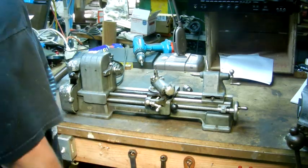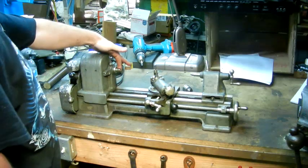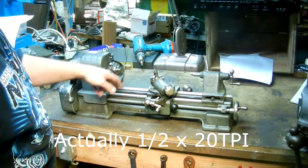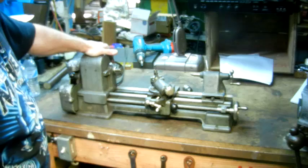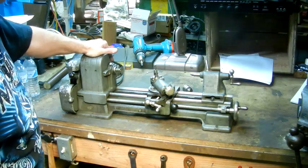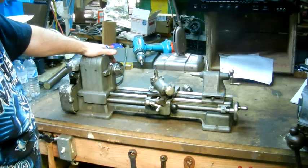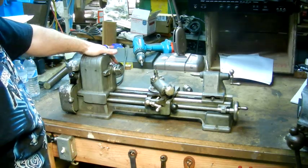It's a six-inch swing. The spindle is a one-half inch by 24 threads per inch spindle. They are quite prone to damage — in fact, this one's got a very slight little wobble in it. It probably needs to be taken out and pressed straight again. These lathes have quite a following, and there are quite a number of parts still available for them, both new and obviously in the second-hand market on eBay and the like.